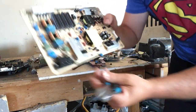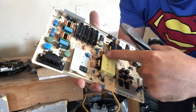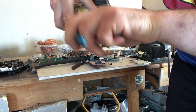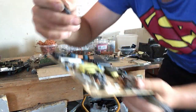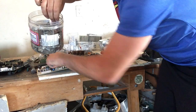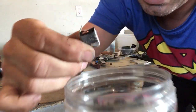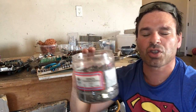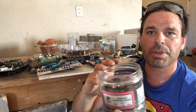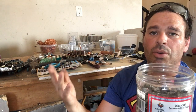My last one here is one of my modern flat-screen boards. You can see some really beautiful copper coils and really nice aluminum. These transformers also have some nice copper in them. There's a small spool here as well — great items. You want to make sure with any aluminum heat sinks that you pull off these prongs, because these have number two copper in them. I have a nice bin stored up, and I broke one purposely to show people — underneath the plastic, that is all number two copper.